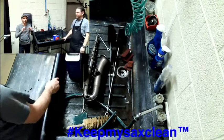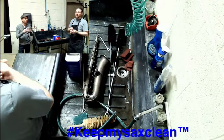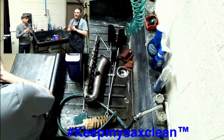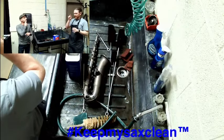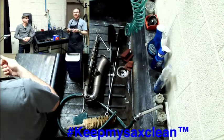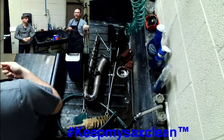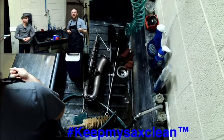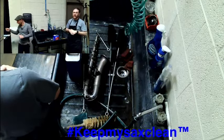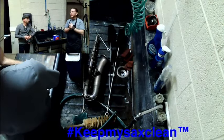What about the actual rods that go in the hinge tubes? I do use a solvent on those — denatured alcohol is good. I also use acetone, but with an asterisk: if you use acetone to clean your steel parts like hinge rods and pivot screws, make sure you oil them immediately afterwards. Acetone does a great job removing all that oil and grease, but it allows air and moisture to hit the metal and they tend to rust sooner. So oil them very quickly afterwards.